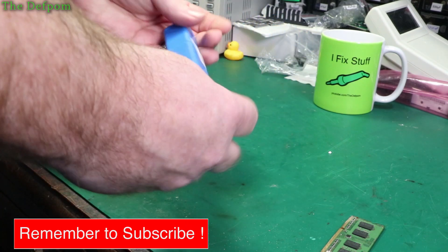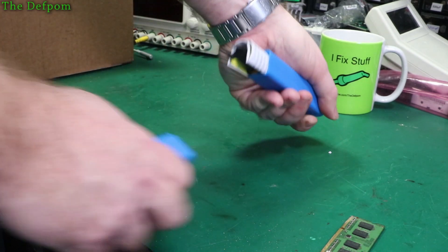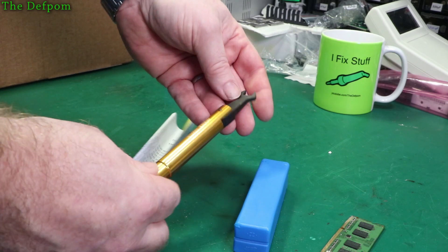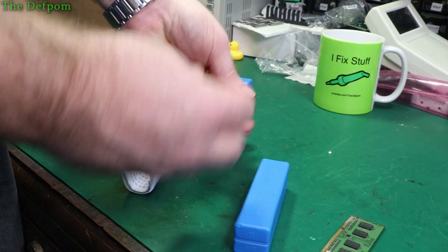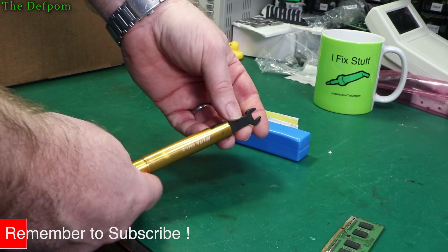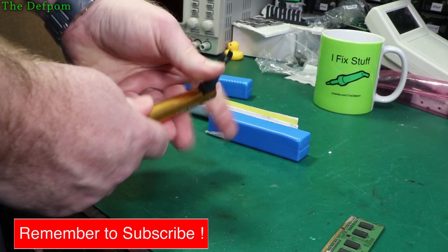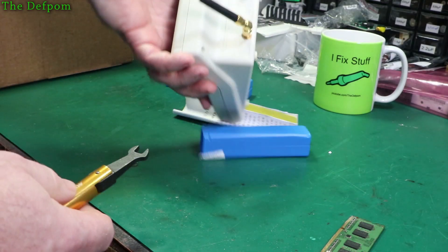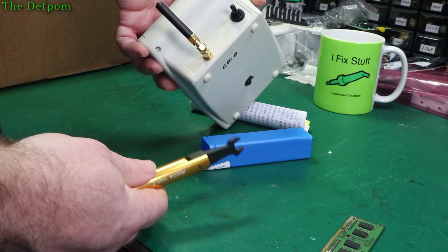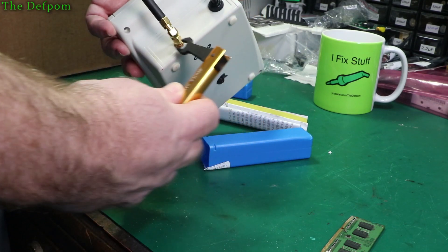What on earth is this? This looks like an industrial kind of drill bit case kind of thing. It's a little torque spanner. So this is meant for doing up SMA connectors, although this is a bit more chunky than I was expecting. So if you've got an SMA connector like on here, the idea is you can use that to do them up and get the right torque. Because it will just collapse over when it gets to the right one. That's the plan anyway.